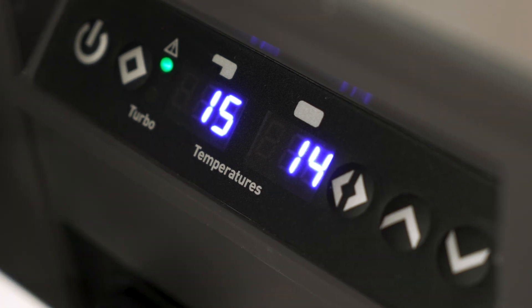Those are the temperatures currently inside the fridge. Now, about battery protection — you have low, medium, and high. Low battery protection means it'll turn the fridge off at a much lower voltage, so it'll actually drain more out of your battery. For high protection, it'll turn the fridge off at a much higher protection level, so it won't draw as much out of your battery. Medium is halfway in between. This will depend on the size of your battery, the quality of your battery, and whether it's at full charge — whether you use high, low, or medium.